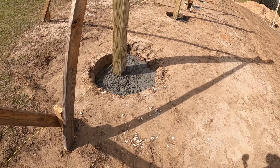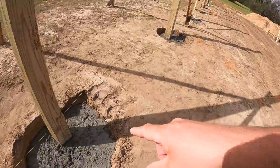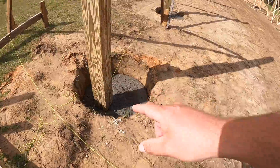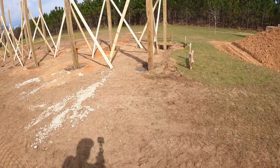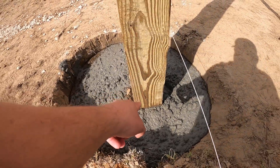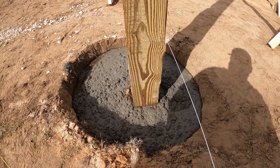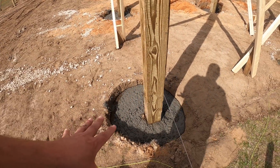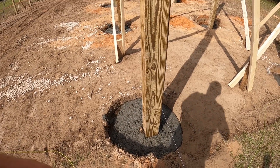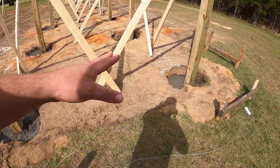These posts needed to be just shy of the footer going in between them. The post had to be in the ground 60 inches beneath top of slab height. They made their deductions and actually made marks on the posts so we know the concrete could go no higher than that mark — because that is technically the bottom of the footer. We wound up doing them all just a little short to make 100% sure we didn't go above the footer, so the concrete guy can come in and scrape that dirt off after he builds his pad.